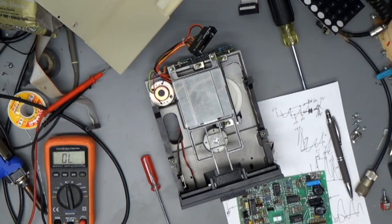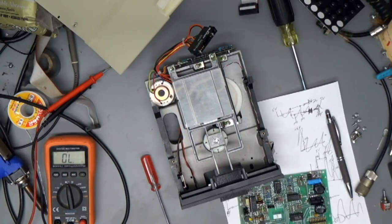Well, I thought that was a voltage regulator the way it worked. That's Q. Oh, okay. All right, so the activity LED is actually running off of 12 volts with a big dropping resistor. Well, that complicates things a little bit, doesn't it? Perhaps we should just install our switch and quit messing around.